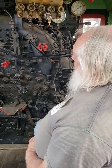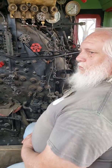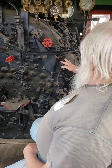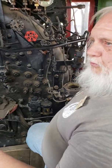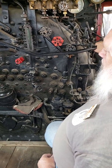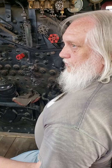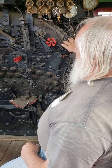Another thing you can do, some railroads did it and some didn't, is what you call mountain braking. It kind of acts like a dynamic brake. What you do is you open the cylinder cocks. Right. If you're running forward, you put the engine just a couple notches back of center, into the backward motion, and you give it just a tad of steam. Right. And that'll cause a back pressure condition that'll cause your cylinders to not move as easily, and it'll act as a braking system. Right, that makes sense. It's preventing them from moving forward as fast.